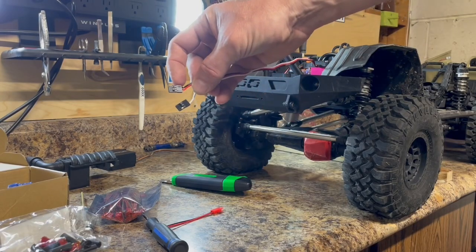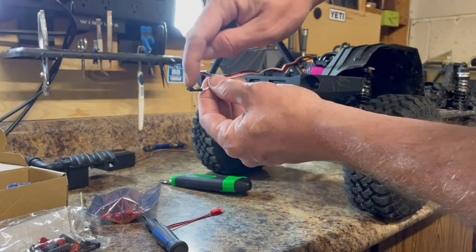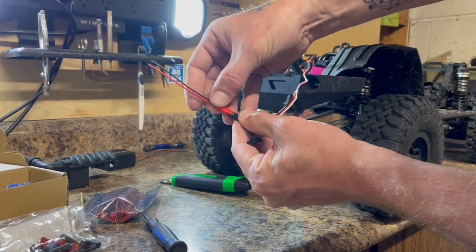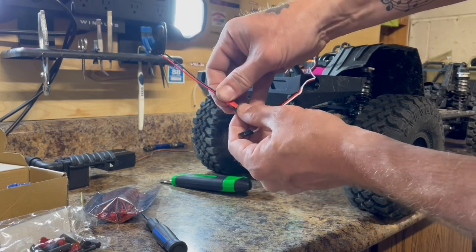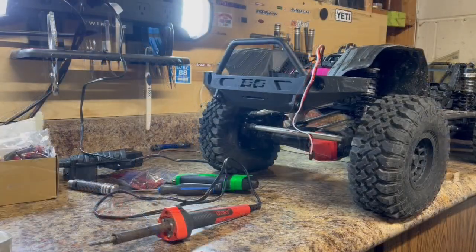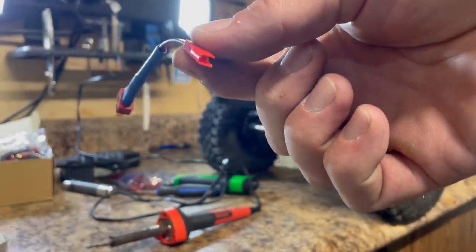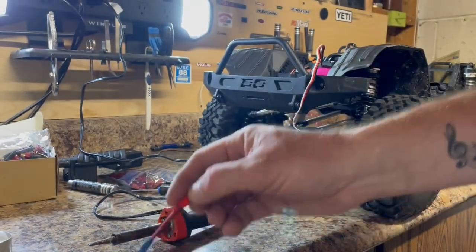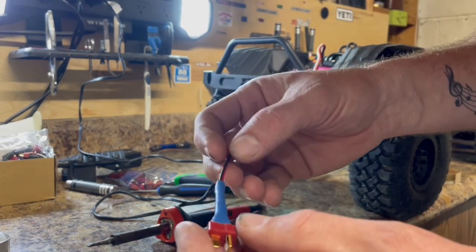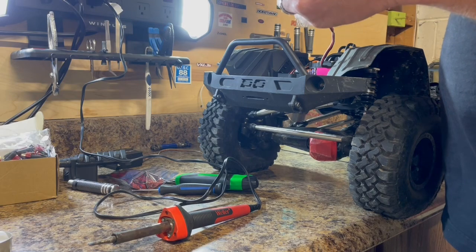Now you'll see this is the steering servo wire. I have the old servo plug connected on this side and my signal wire separate. I'll have to peel these wires apart so that this can go into the receiver box where it's sealed up. I'll get everything soldered up — my negative on this little mini JST, or whatever these little plugs are. Here's my connector that goes to the battery, and this end is going to power the servo directly. I made that up real quick. Now these wires are pretty small; I might have to do something a little different down the road. But for now let's plug this in.